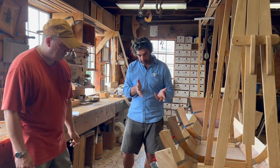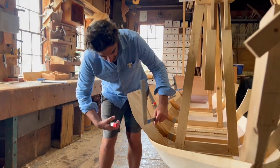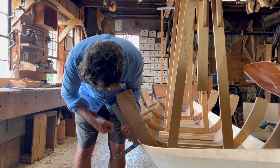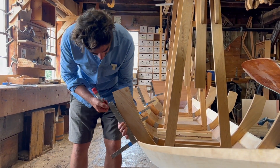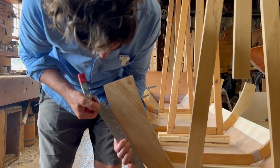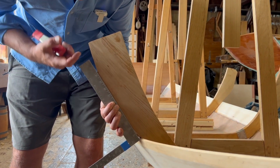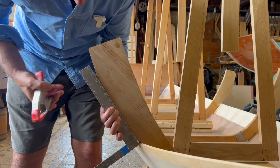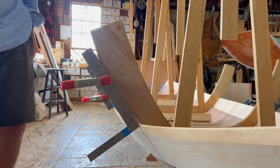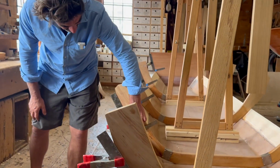So the deal is, I'm going to move this for 1 second, John. Take the straight edge here and put the corner right on the upper part of the lap, and then I'm going to rotate it in until the 10, this is up 10 inches, until the 10 is just, what do they call that, tangent with the intersects the frame there, and that is your 10-inch. You're going to do that all the way along. John's done that here. He's just utilizing the inside there.